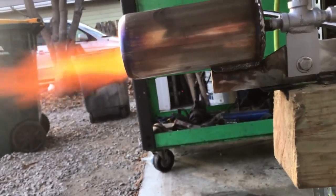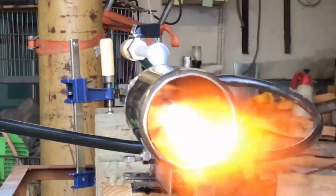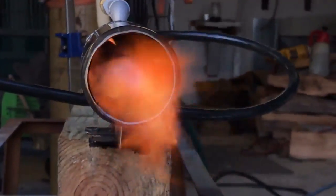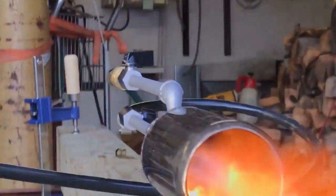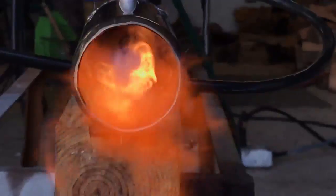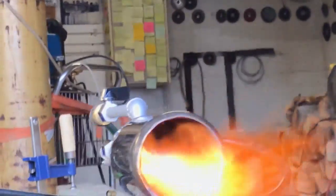This is the footage from the waste oil test that we did — this is some diesel oil that's contaminated. And as you can see, our flame is dumped onto the bottom of the combustion chamber here, even with the nozzle properly aligned geometrically. Now, that just goes to show you what about a couple thousandths of an inch can do — I'm talking about a human hair. You move that inner pinstock a human hair out of alignment and you get some extremely undesirable effects.